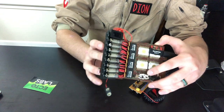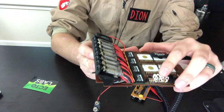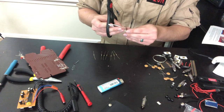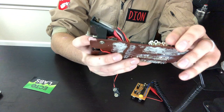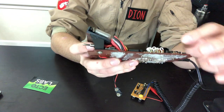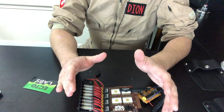One complication is there are some small capacitors with heat shrink tubing. You'll have to measure out and cut this tubing, then shrink it with either a heat gun or a lighter for the individual ones, and then curve them. I took one of my small screws and bent the wire into that question mark or R shape to get the right form.